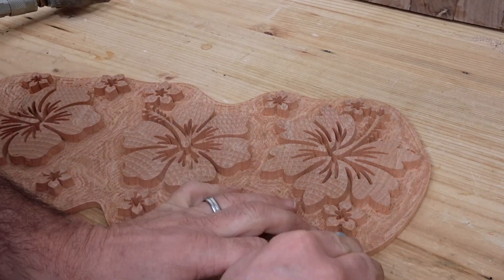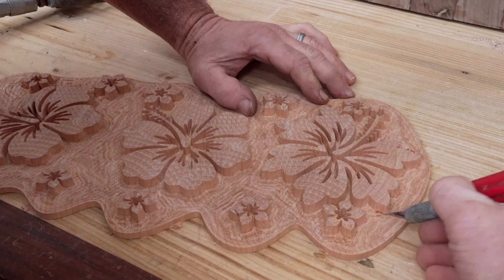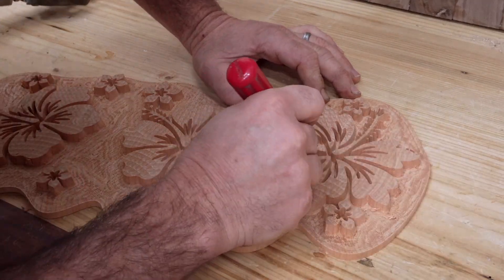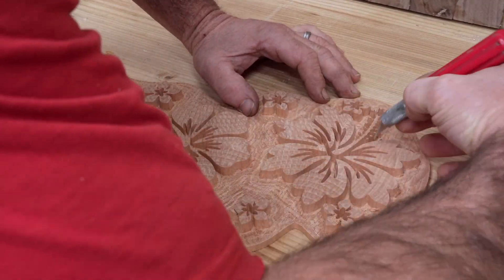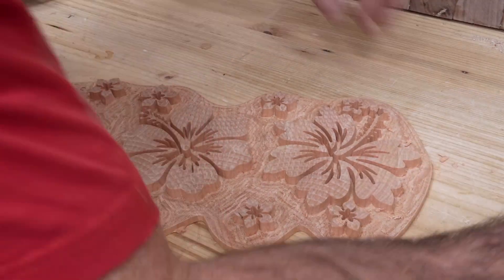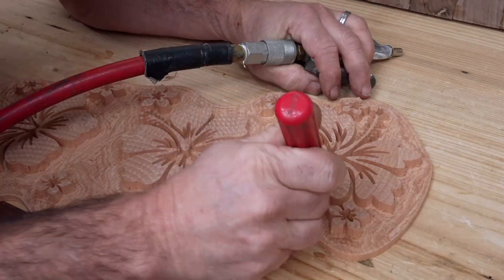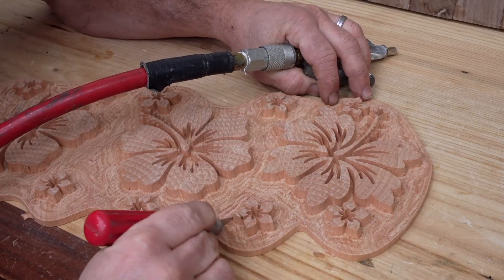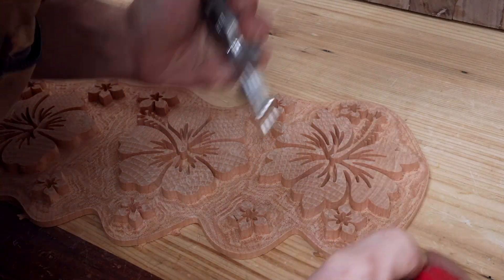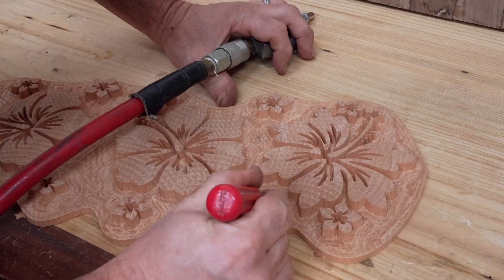I'm not a big fan of busy work like cleaning up the fuzzy parts of a plug. I thought about it a bit, and this is really something that the CNC machine could take care of — I could just have it cut a clearance pass just a little bit narrower and eliminate a lot of the fuzziness that I was seeing. So I actually made this a parameter option in the plug-in that I made.